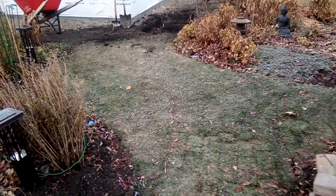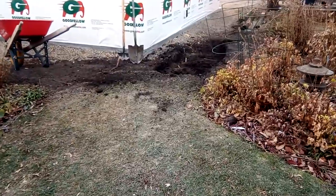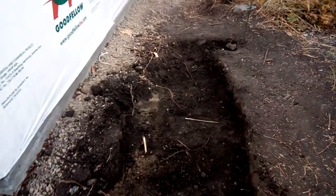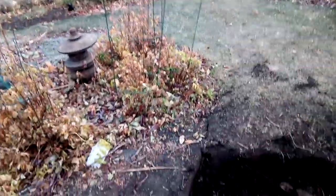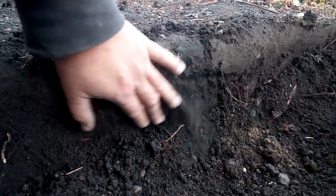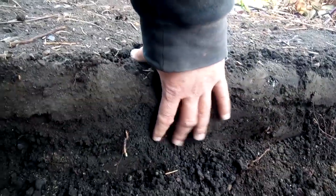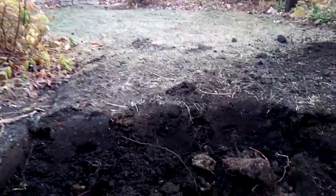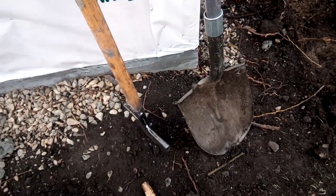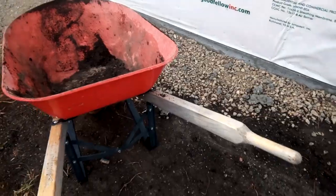Maybe you don't want sod mixed in with your loam. Then your layout — I did the edging in a layout, it's super hard to see here. We're going from the deck to a door, to the new garage, just trying to get the layout of your pathway. You saw it at the beginning of the video — get something that works for you, nice and flowing. I'm excavating about six inches, but you might want to check your local code. You need to put a gravel base in — the more the better.